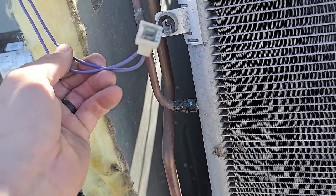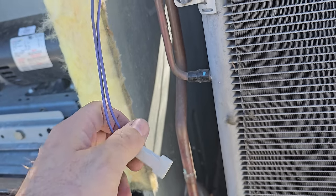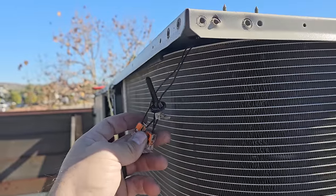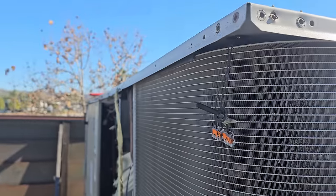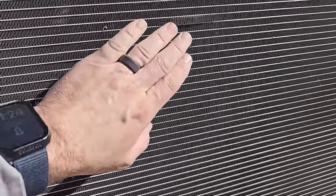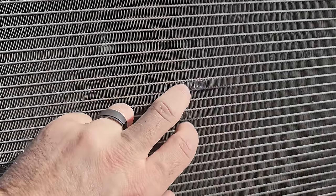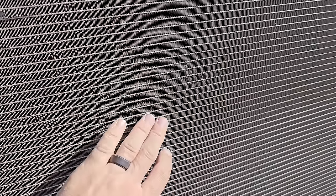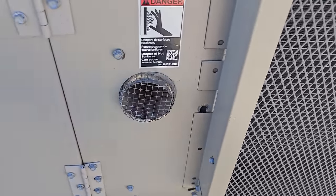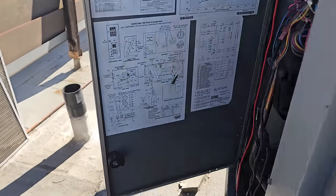That's why we got no sensor reading — that's the connector right there, pulled out or something. I put two Wagos right there and need to get to the back side to fasten it back in. I also noticed the microchannel fins — look at how they're coming out in several spots. It's only slightly doing it, but that's interesting — the fins are just pushing out. Never really seen that before. I got the condenser all back together. The bottom fastener is stripped so I'll have to deal with it, but it seems like it'll be fine.